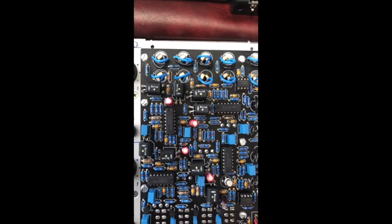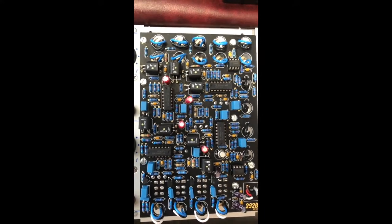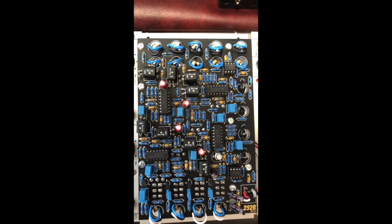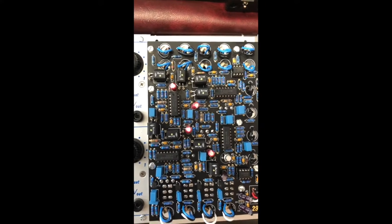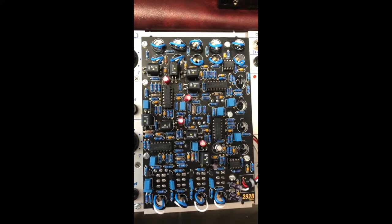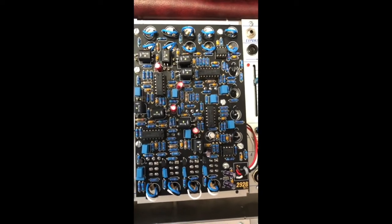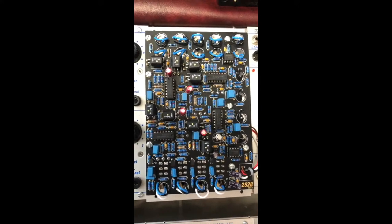The B actually uses 8 Vactrols, so it's a completely different circuit. There's a lot more capacitors, and they're X-Vive Vactrols. So they sort of took over for Augustus Technologies, making the same Vactrol types. And they're thought of as not having as good of decay, but in the 292B circuit, I feel like that is definitely not the case, as we'll find out.